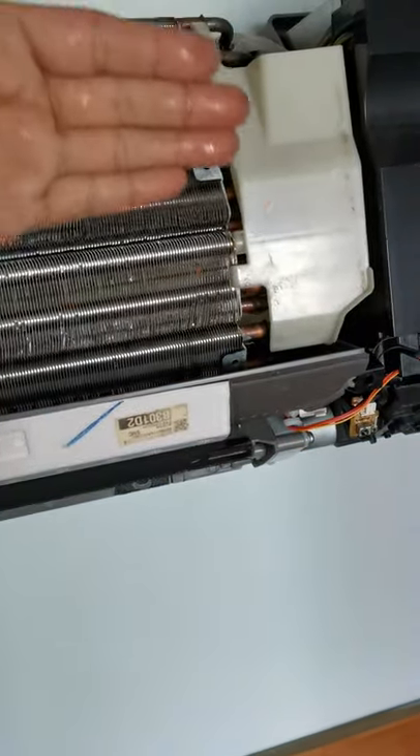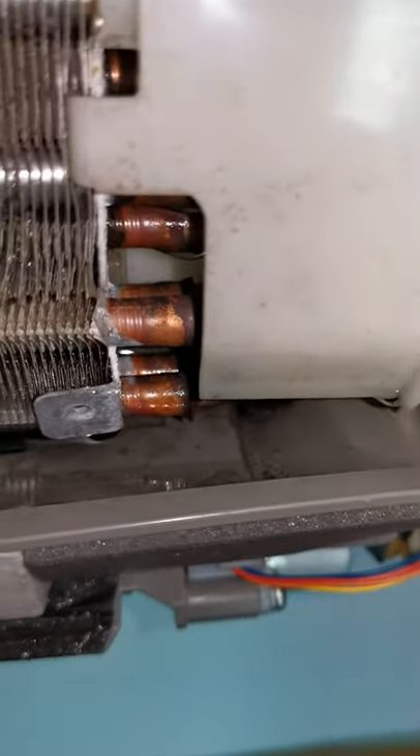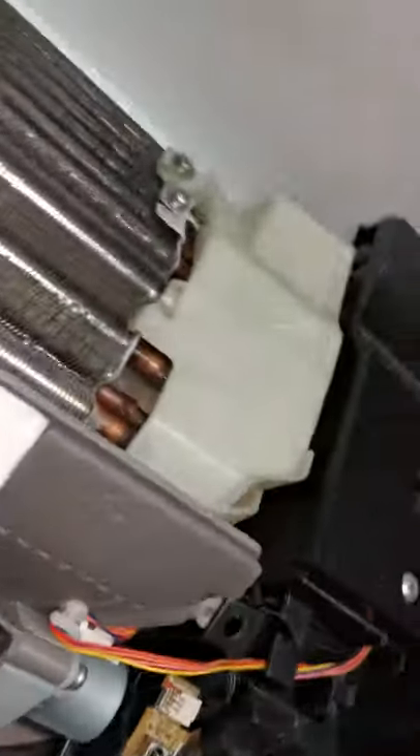This condensate water goes down into a water tray. This unit is actually having a water dripping issue — the water tray is full of water. All the water collected is piped out via a water pipe, then it goes inside the wall, under the floor, and discharges into the toilet. For condominiums it's hidden under the floor, so when your water pipe clogs, it doesn't discharge and the water level rises.